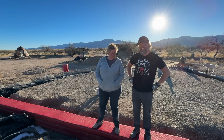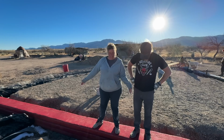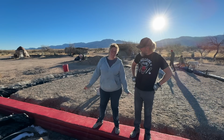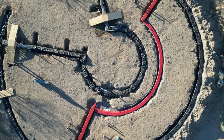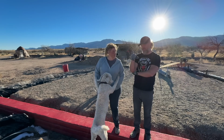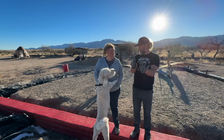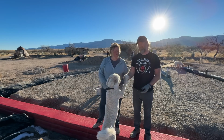So I was looking at this wall as we were laying it. I'm like, this is more than 10 to 12 feet. And I couldn't remember our measurement, so I walked it off, and it's about 16 feet without any buttressing, from the inside wall to this next wall over here. So we're gonna have to do some measurements and see if there's a way we can put a buttress maybe into the bathroom, like a little tiny buttress. I think it'll probably be okay, but it's a big wall.